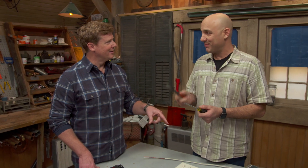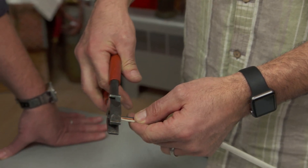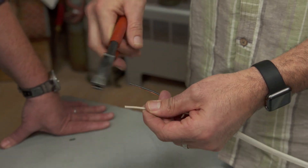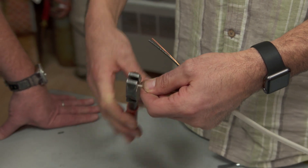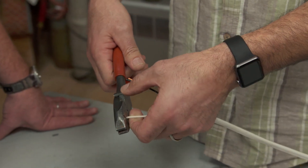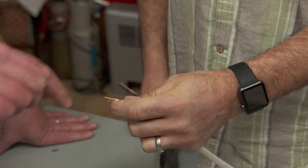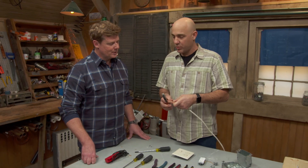And you guys never put the lineman's down. I sleep with them. So you use it for all the obvious things, right? Cutting wires, splicing wires. With this cutter here you can cut wire all day long, no problem. The insulation on the wire needs to be stripped, so you take the same cutter, just kind of put it on there, kiss it a little bit, take your thumb, push it off — strip it, no insulation. Once it's stripped, you can splice them all together. You splice them together, twist them, put the line on.